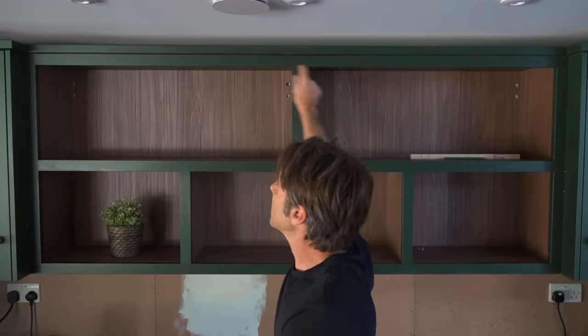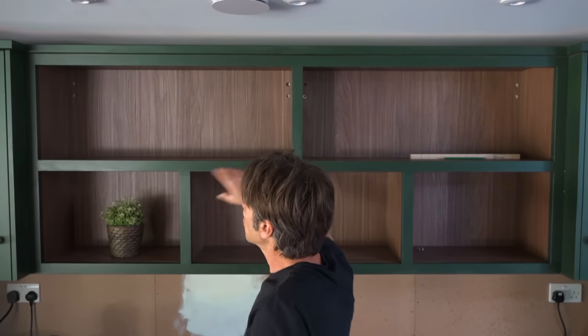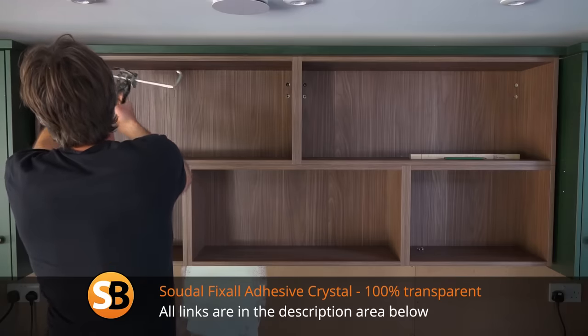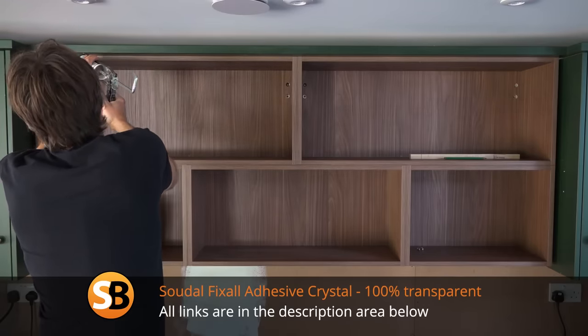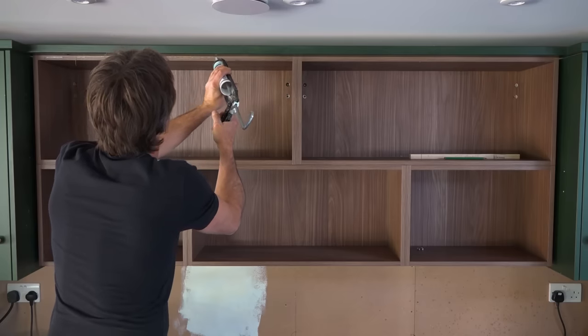So I've fitted the first of the cornice sections - there's another moulding that goes in front up to the ceiling which will go on next week. I've got here this front that I made to go over these units. I've shot it in, it's all perfect, it all lines up with all of the shelves. I'm going to remove it, put the polymer on, carefully replace it, make sure it's all nice and flat, then put a number of brads in just to make it hold until that polymer sets. I'm using an extremely small bead, trying to make sure it doesn't come out anywhere - keeping the bead closer to the top of the work than the bottom, and dead in the middle.